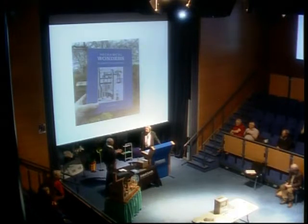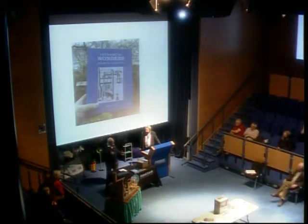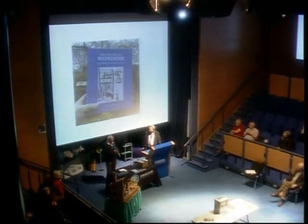And a screw, you wouldn't be able to go down 16th full size, would you? But what I've done, I go down to 14 BA, which is pretty small. For some idea of the size of 14 BA, I put a thread on the end of a paper clip. That's the 14 BA. And thread the end of it and use it as a stud.